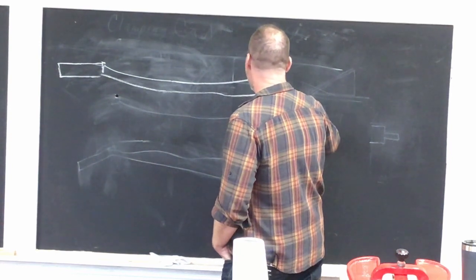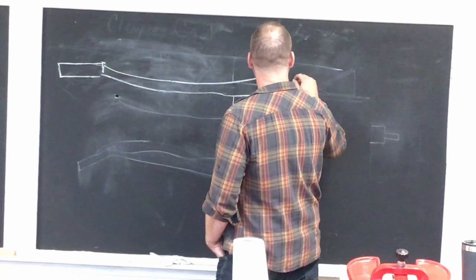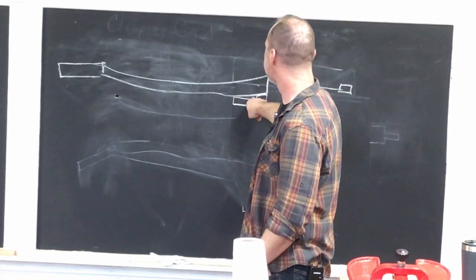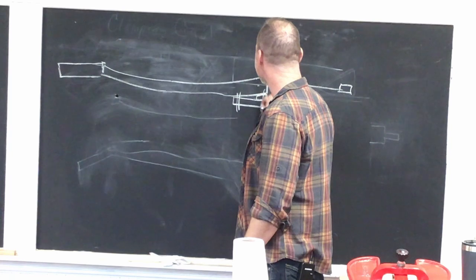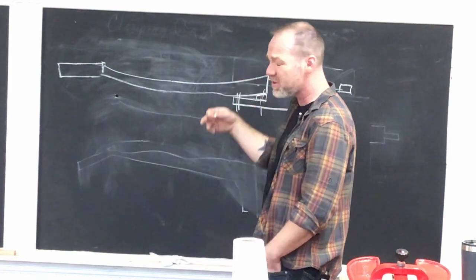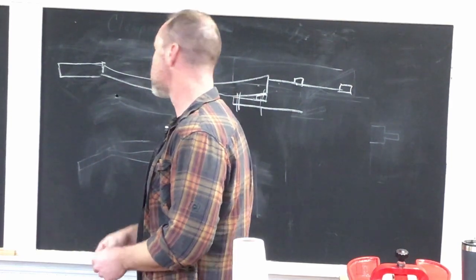So when this is joined to a body, typically Fender and most bolt-on builders put a shim here, and that's the bottom of the body cavity. This, where your pickups are. It's a terrible drawing, of course. All right, so in here you have this gap, and you're actually putting 2 screws here to bolt it on, and 2 screws here to bolt it on. And essentially, over time, that air gap ends up slightly warping that whole neck. Usually not very much, maybe 10 thousandths of an inch, but 10 thousandths of an inch is going to keep you from being able to bend the string and not choke out, because those strings are going to bottom out.